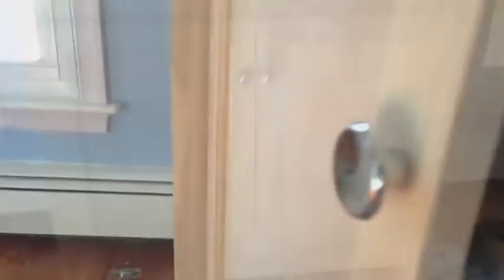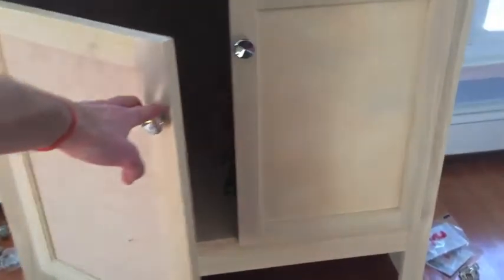Last thing is the handle. Quarter-inch drill bit — mark even holes and screw the handle in. You can pick your own handle style to match your cabinet. And there you go guys — reveal adjusted, knob installed, perfectly working cabinet door.